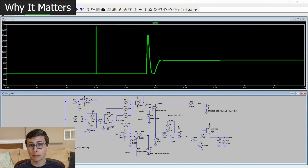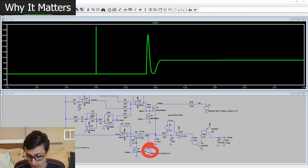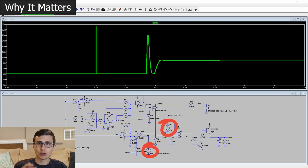And what we could do is we could have a DAC. We could have a programmable voltage source that is used to set our target voltage. Likewise, we can have a DAC that sets our overcurrent voltage. Or, even better, we could use a DAC and a resistor divider such that our overcurrent voltage is always some percent above the set point, so that we can use one DAC and accomplish both functions. That could be pretty cool. Two birds, one stone, one less component.